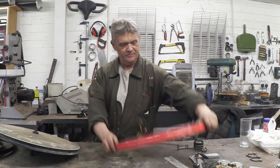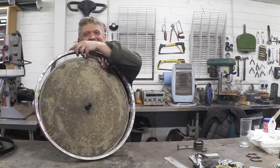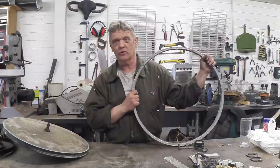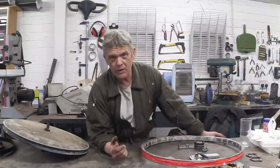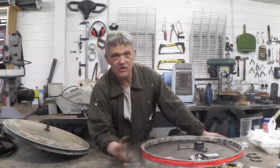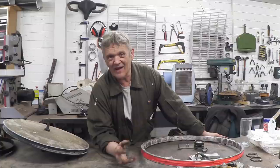Now I don't know if you remember this thing — this is the flywheel. One person asked what I was going to do with it, and what I'm going to do is put those two together: stick some magnets on here and then we'll see what that generator can actually produce. The point of it is there are 36 poles on here and I only had to wind one big coil. I didn't have to wind 36 little coils and get them all arranged — this is beautifully true with 36 little poles and one big coil, so it was much much easier to make. One of the benefits is it's easier and cheaper to make. We know it will perform to some degree because we've just shown that it does, and it's based on the idea of an alternator and on that thing from microwave ovens you see all over the internet, so it stands a very good chance of working. It is a bicycle wheel, so I'll temper expectations a little, but I'll certainly be doing that in a future video.